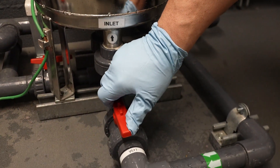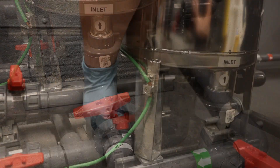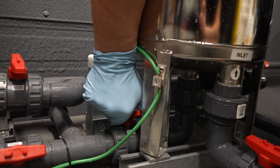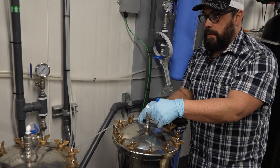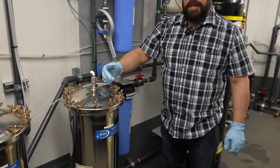To begin the maintenance, you shut your inlet valve, you shut your outlet valve, and you open your drain. Disconnect the drain line and open it up so that your water will drain faster as this sucks in air.